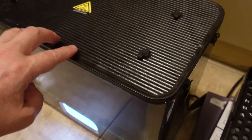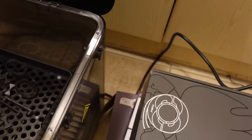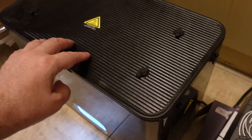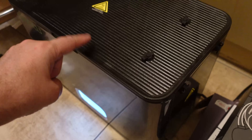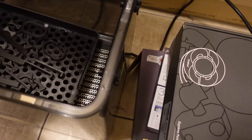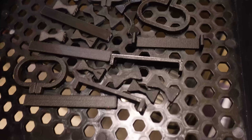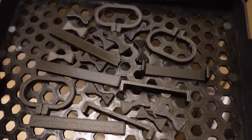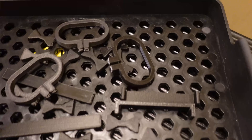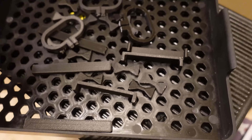This is filament dryer E2, which is preheated to approximately 90–95 degrees Celsius for one and a half hours. The objects cool down together with the dryer. On first look they appear okay but I can see some changes — for example, the distance between two reference surfaces is different. I will measure these; they should be 80 millimeters.